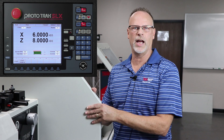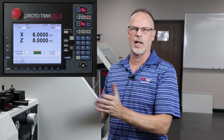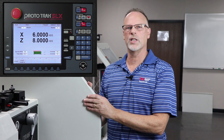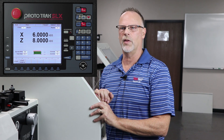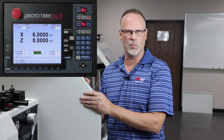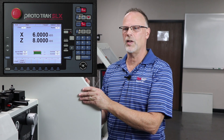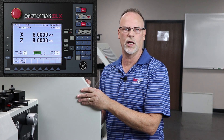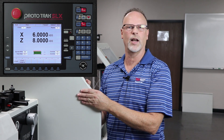And there you have it — pretty short and sweet. The truth is, if I had to make multiple parts like this, I might track it the first time to make sure I know what I'm doing, but next time I'd just hit CNC run and let it make those parts faster. The theory of how you do it is the same regardless of hole size or tap size. For bigger holes I might need to step up using multiple drills with different sizes and lengths. For a really big tap I'd have to run it slower and switch to low gear on the 1845, but I usually pick the slowest speed I can keep in high gear so I don't have to switch back and forth.